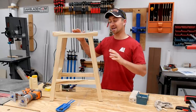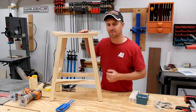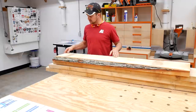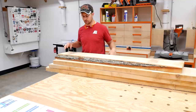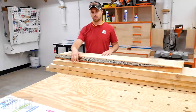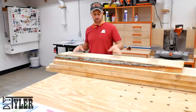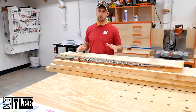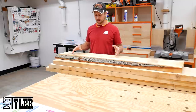It's a little bit messy around me because I actually am making three of these bar stools, but I only got one done ready for this video. These stools are going to be made out of solid maple wood and I got a couple of 8 quarter slabs here, about 50 board feet, which is more than I need. I'm hoping to get the three stools out of two or three of these slabs. The only restriction I'd like to put on the project is I would like the tops of all of the stools to be from one board so that hopefully we can get a continuous grain pattern as the stools are sitting there by the counter.